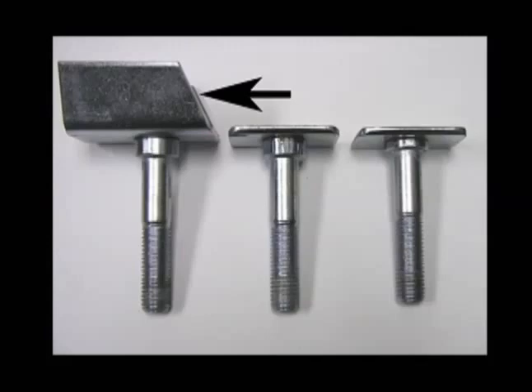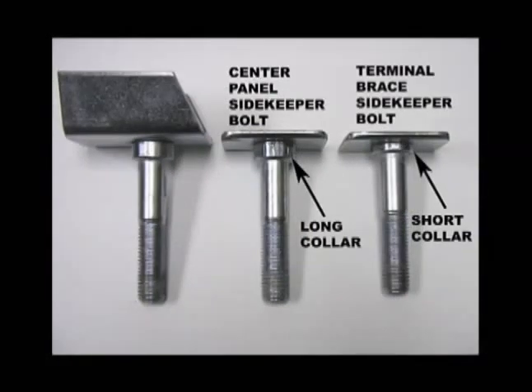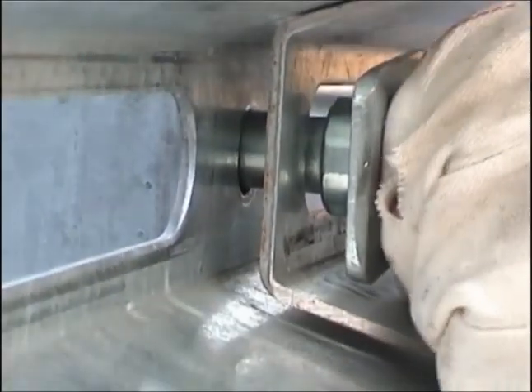The taper on one side matches the sled panel taper. All of the center panels have a collar that is designed to pin the side panels to the mobile frames. However, the side keeper that goes in the last terminal brace has a shorter collar because it does not pin a panel to the mobile frame. The side keeper bolt collar rides in the slot on the outboard side panel. This collar pins the side panel on the inside to the support frame. Be sure to seat the collar into the side panel slot.